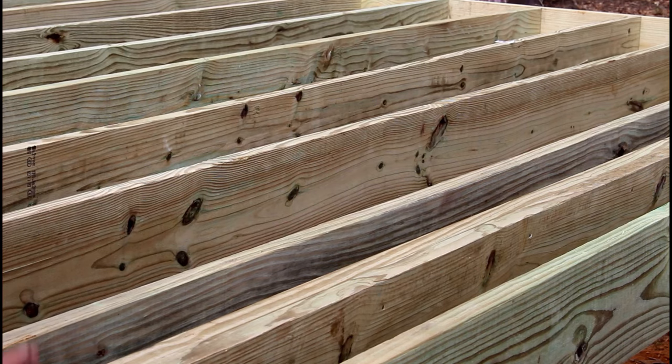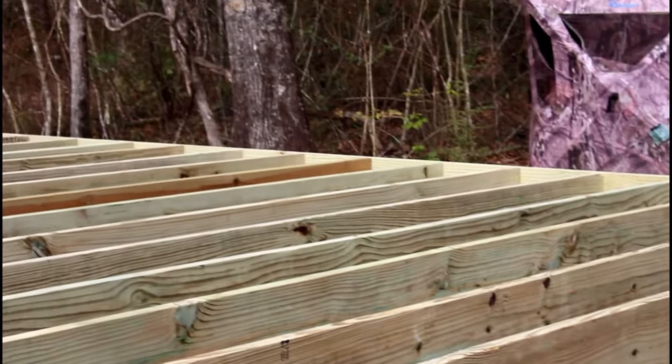Okay guys, we've got the girder installed now for our wall to sit on. So we're ready to begin our bridging in between the floor joists. And the thing that we've run into is that plywood now says it is 4x8 sheets, but it's not really 4x8 anymore. It's 47 7/8 inches long because you have to leave an 1/8 inch gap at the end for expansion and contraction on the flooring. The width is not 48 inches anymore. It's 47 5/8 inch is the coverage of it. Even if you leave the 1/8 inch that they're asking, you only end up with 47 3/4.